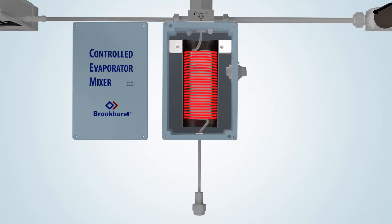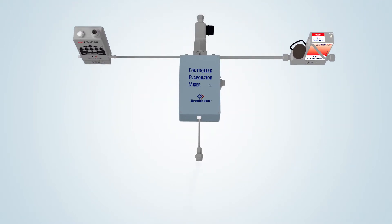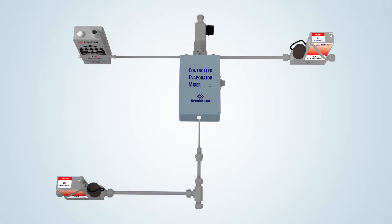Using the VDM module, vapor flows within the range of 50 millilitres per minute up to 10 litres per minute can be generated for use in atmospheric or vacuum processes. The standard VDM configuration comprises one liquid flow meter and one gas mass flow controller or MFC. The evaporation module can, however, be equipped with an extra MFC for dual carrier gas supply. Another option is to dilute the outflowing vapor by adding an extra MFC at the outlet. And, of course, these two options can also be combined.